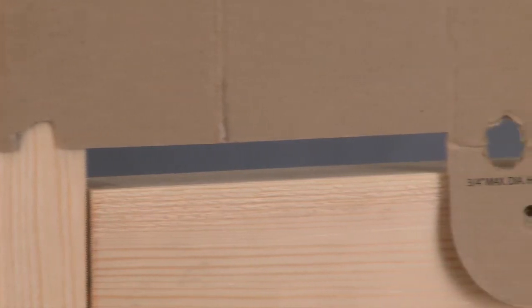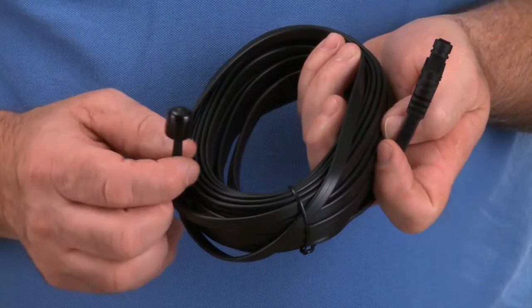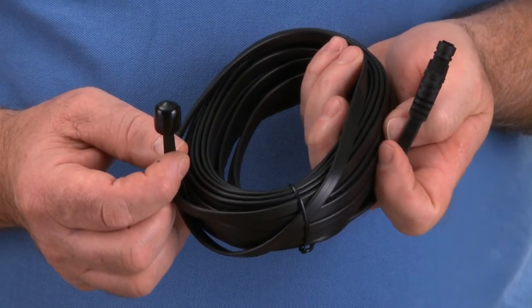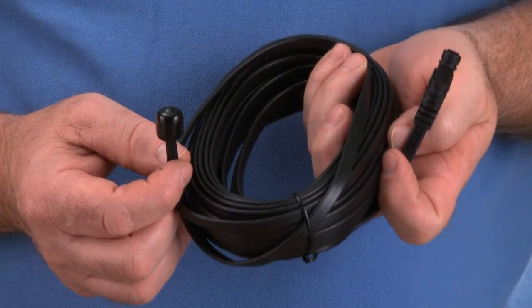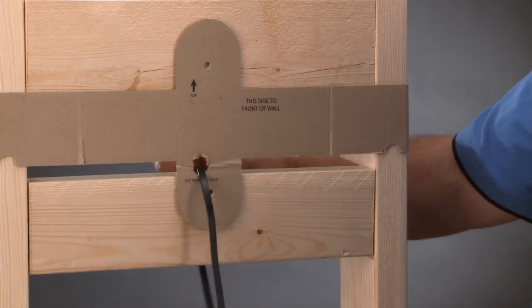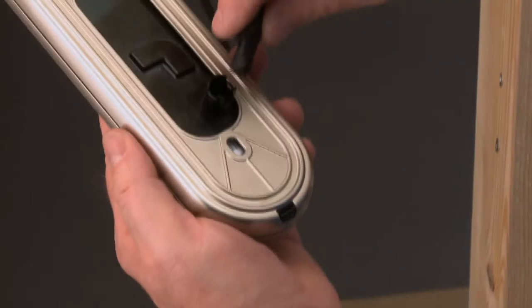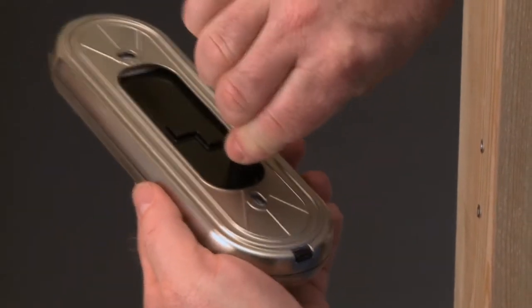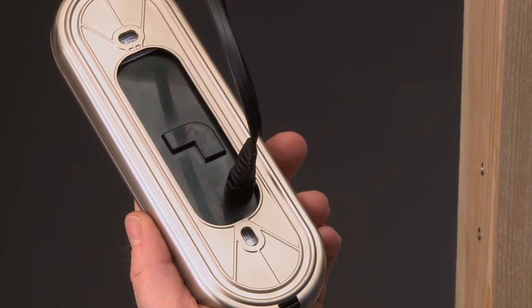Install a 2x4 above and below the template. Be sure the bottom 2x4 is below the small hole in the template so it can be accessed. A 30-foot data cable connects the IO Digital controller and valve. For added safety, leave the protective cap on until final installation. One end of the data cable goes through the small hole in the template and is inserted into the back of the controller.